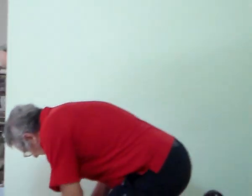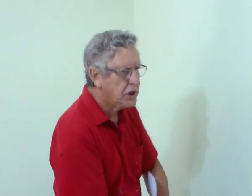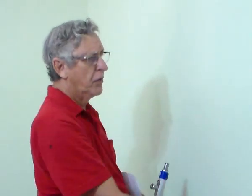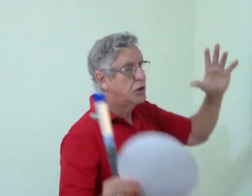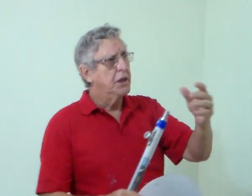The other thing I'm going to show you to try and help you — there's a little pad that goes on and you screw this in like that. When you're sanding your walls down, that's a 240. You just go up and down, walk backwards and forwards. All you're doing is giving a light little scratch so the paint can adhere to the wall. Also, I always wash my walls down before I paint, because you'd be surprised how much fly spray can get on that wall. Fly spray is oil-based, especially with grandma doing the old pump spray up in the corners. I did a house once on a farm — I thought I'd cleaned it all down, but up in the corner a big sheet of paint just lifted straight off where grandma had used her old pump fly spray. So wash the walls down, give it a light sand, and put it on your pole.